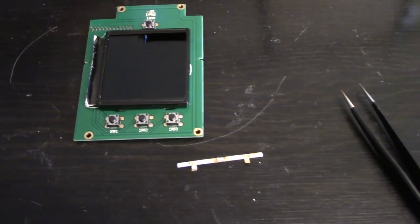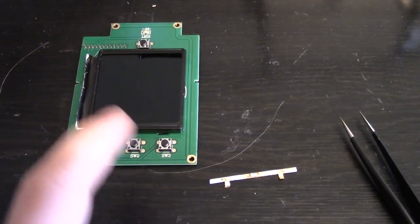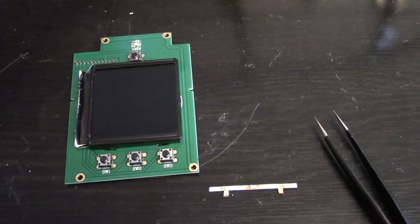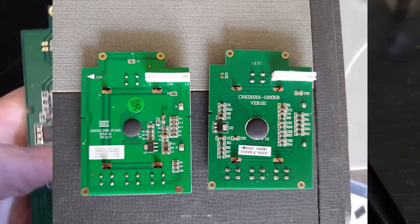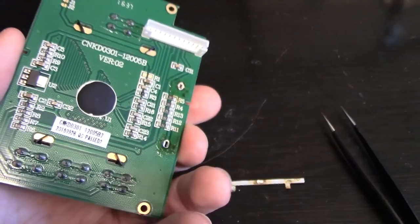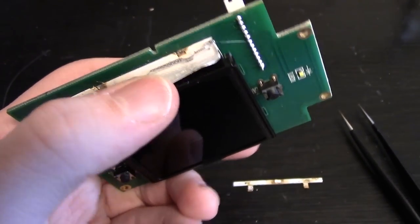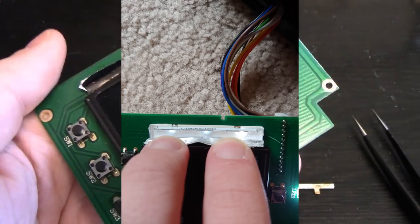There is one other thing about these UPSs I wanted to include here. I kind of lied about the differences between REV1 and REV2 — there's actually another one, and it's the display board. It's actually the biggest difference between REV1 and REV2 other than the charger. It's a completely different board — they respun it entirely. And the version 2, unfortunately, is horrendously unreliable. The backlight is a different model with very poor-quality LEDs, which eventually fail by either going out completely or going very, very dim, so the screen gets really, really dim.